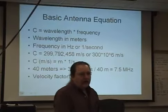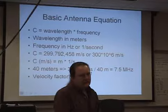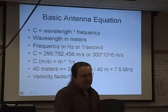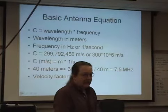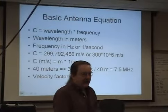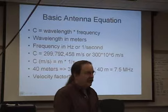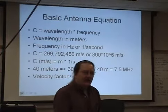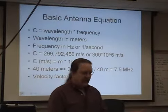a dipole is a resonant antenna. It's got two legs and a single feed point. A doublet is the same system, but it's non-resonant. So when you get a G5RV, it might be resonant at a certain frequency, but it's 3/2 wavelength, and it allows me to work on almost all of the amateur HF bands. I can tune to all of them. And if mine were long enough, I could work on 160. But still tune 17 meters, 30 meters, 40.